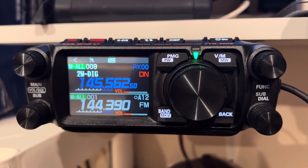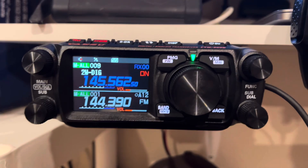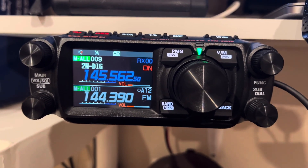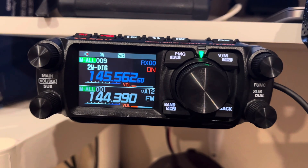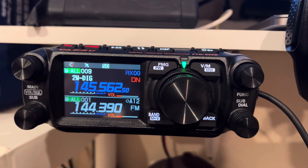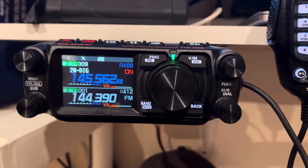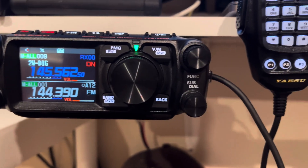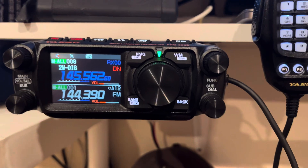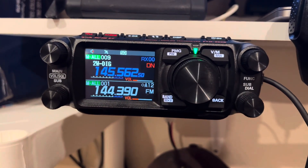That's why I recommend voice alert over APRS mute. This will work on any APRS radio, and if you don't have a voice alert option in the menu, it's very easy — all you have to do is put a 100 Hz tone on your transmit frequency. I'd recommend having your standard APRS memory channel as normal, and then a second APRS memory with a 100 Hz tone, so you can easily click back and forth to switch between voice alert or not.